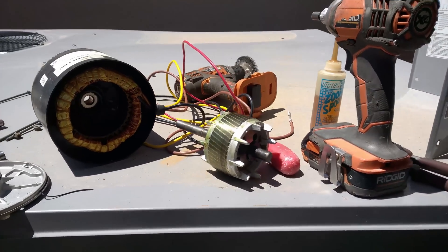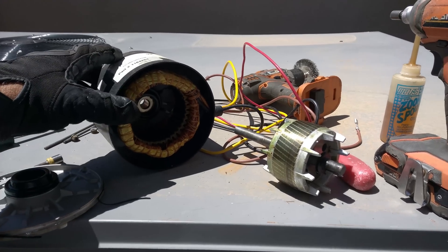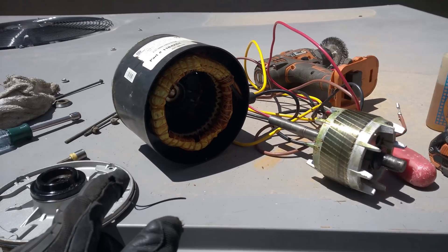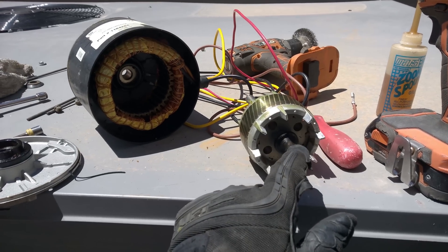What's up guys? This is going to be a little bit different of a video — something I have not covered before. This is an awesome example of what happens to a motor when you put a low ambient controller on a sleeve bearing motor but do not maintain a minimum speed enough to cause proper lubrication to the motor.